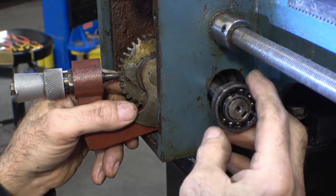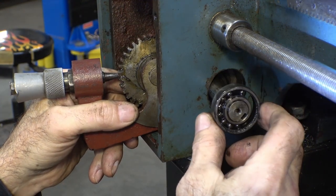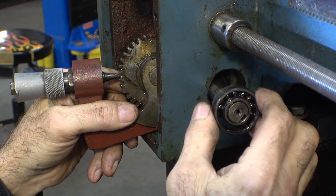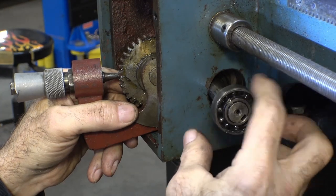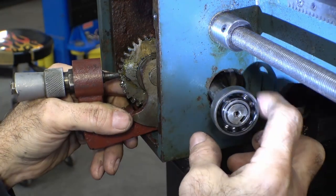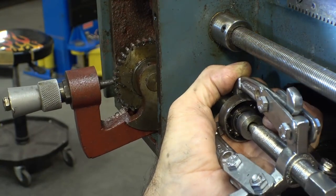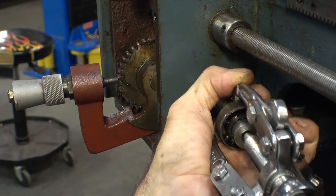Before we pull this off, there's the condition of that bearing. The carrier is pretty much gone out of it, and the balls are all going to wherever they want, and when I turn it, I can feel it catch, move. Moving smooth now. She's not in too good a condition, though. Now, let's see if the bearing pulls off or pulls apart.